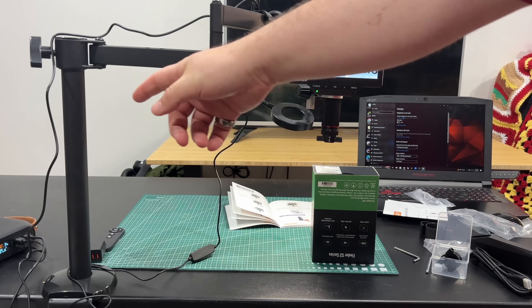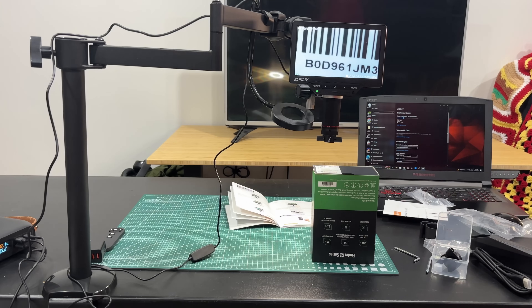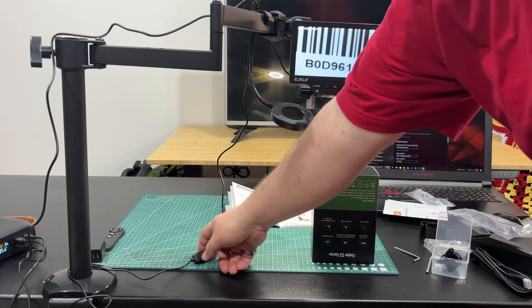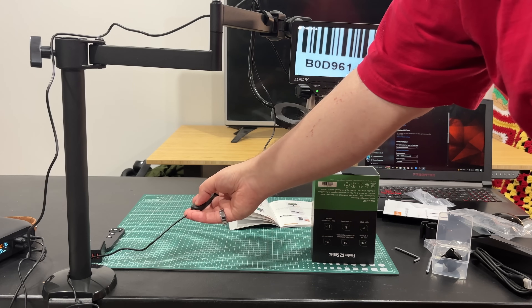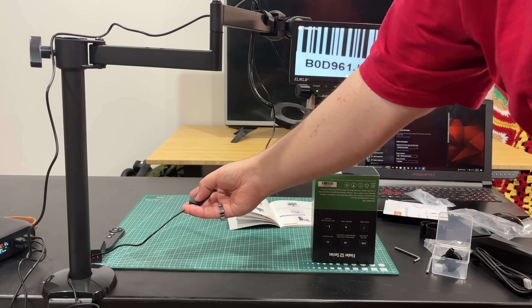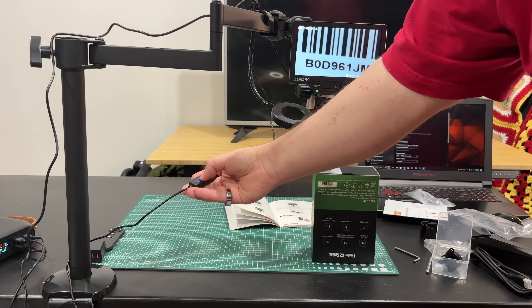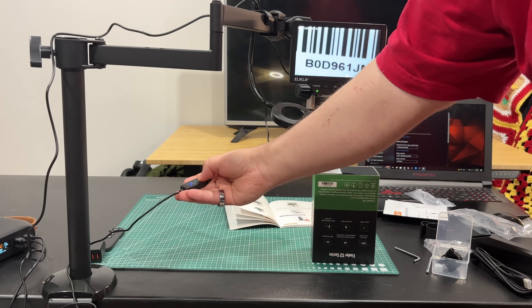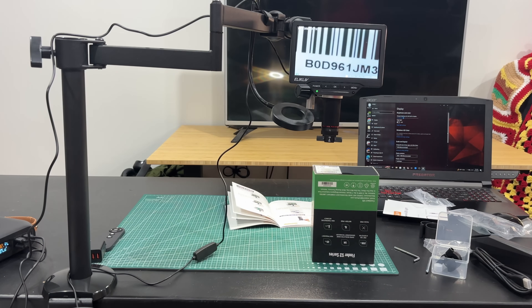I have this plugged into a USB battery bank that tells me the wattage draw. With the light on, the screen, and everything running, I'm drawing seven watts — that's pretty cool. When I turn the light off it drops down to about two watts. The light adds another five watts at the highest setting. Obviously you can turn it down to get that a little lower, but at the highest setting you're drawing seven watts. That's actually pretty impressive.